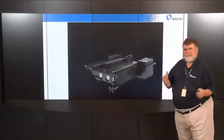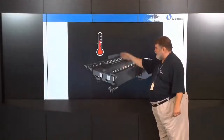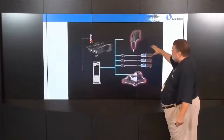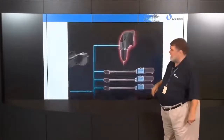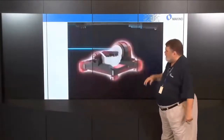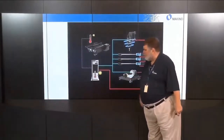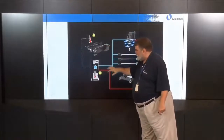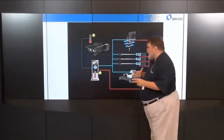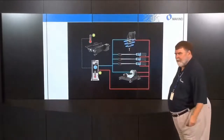How do we control temperature? We have massive cast iron with a thermocouple constantly monitoring the bed temperature. An oilmatic unit maintains temperature within two degrees of the bed temperature. We have a jacket around the spindle, core-cooled ball screws and bearing packages, and a jacket around the DD motors for tilt and rotary. All of that loops back to the oilmatic unit, creating an ambient manufacturing zone of all components to eliminate thermal effects on your part cycle.